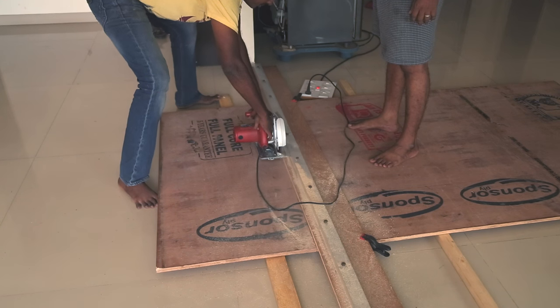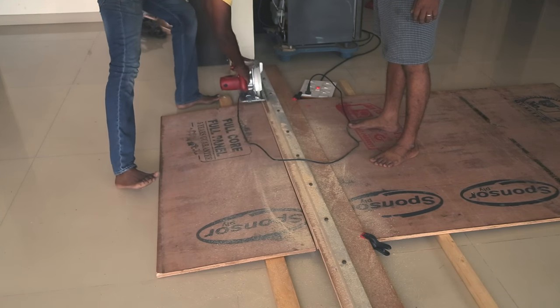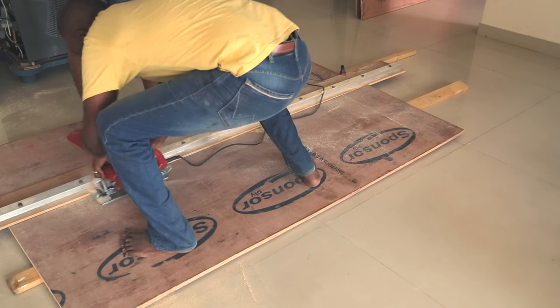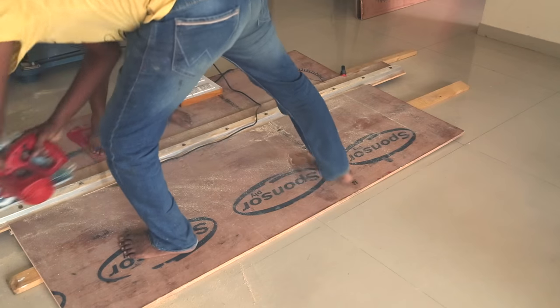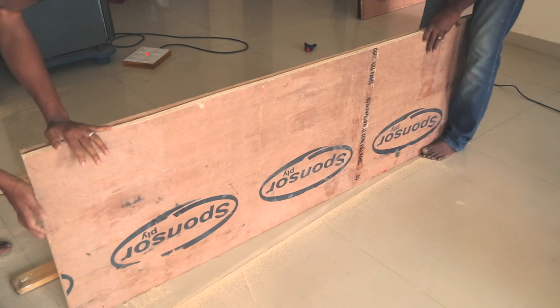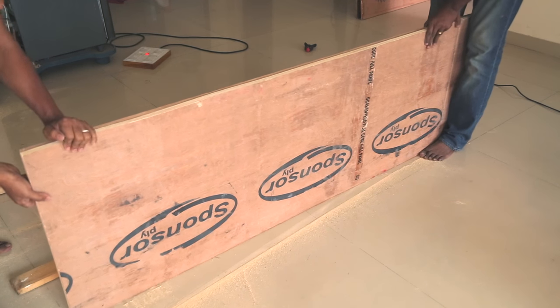The length of the bed legs needs to be just six feet, so I am cutting out the excess. Then I split the plywood into two equal halves — this will give me the two pieces of the leg that I want. I calculated that for a bed the perfect height is 18 inches from the ground, which is almost two feet, so I will cut this later to size.